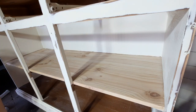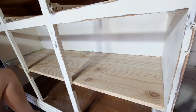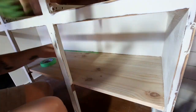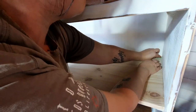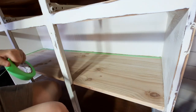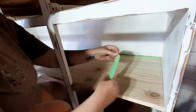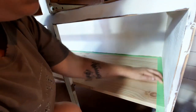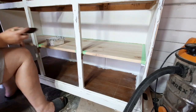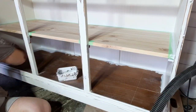I'm going to be painting the inside and I'm using 25mm Sleek tape to protect the freshly sanded shelf from getting paint on it. When taping into corners I like to tear the tape so it has a bit of a beveled end — it makes it so much easier to get the tape into the corner without it going over onto the other side. Starting off with a 25mm Sleek brush to cut in around the edges with Cartamelli primer and adhesive bond.